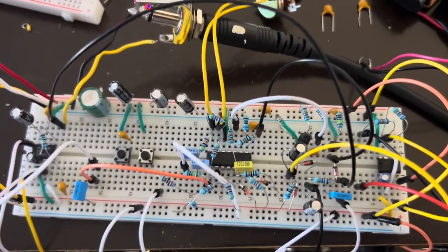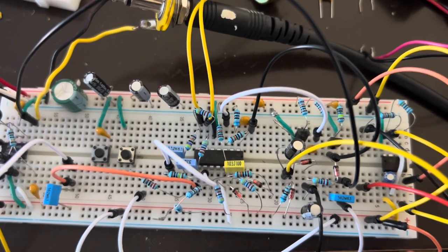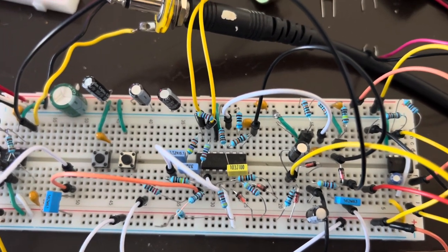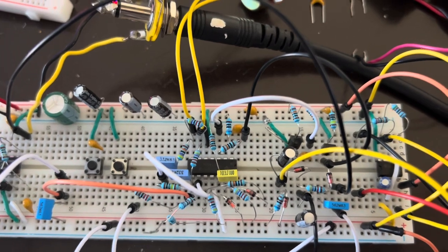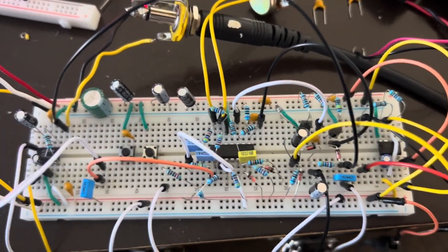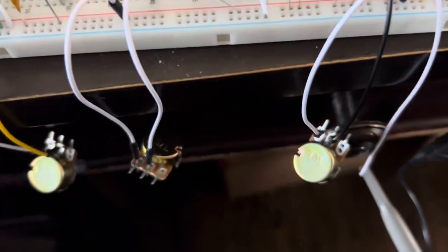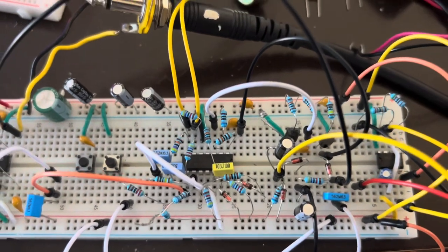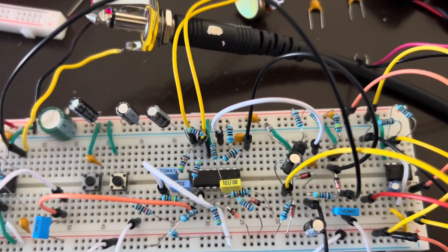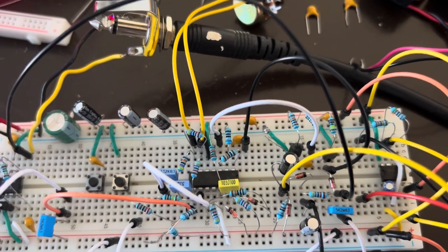So I used the white noise generator from before, and I created a snare drum circuit. All I had to do was add a voltage-controlled amplifier, and an envelope generator, a swing-type single transistor envelope generator. It's going out to the speaker. And basically the envelope creates a decay type of picture that's controllable with this potentiometer through a 10 microfarad capacitor and a 1 meg potentiometer. And it's got a sharp little punch coming from the LFO, the initial peak. And then after that, it decays down with the white noise.